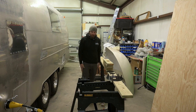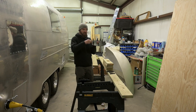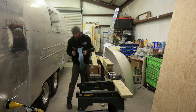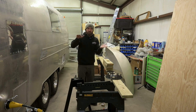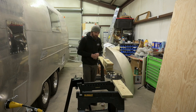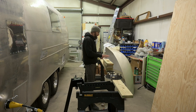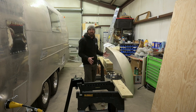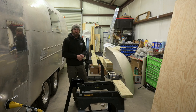It'll move the frame up and down so we can then rotate it. On this front mounting plate — it almost looks like a Gatling gun — we put these tubes on here, we welded those on, and we have little pins on our mounting attachments that are going to lock in there so we can put the frame at different angles and lock it in place. We're going to bolt all this together and get the hubs on. Currently Gabe is drilling out the hubs to get them to half-inch size so we can use bolts. Then we're going to bolt this together, take it out to the gantry, put it on there, and test it out on a frame.